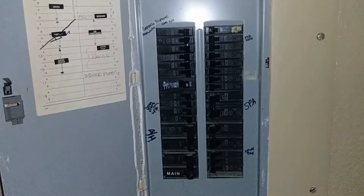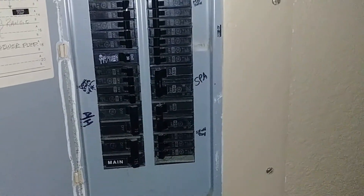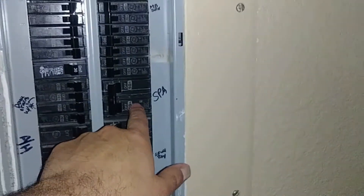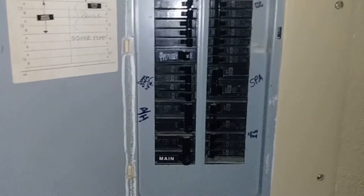So if you're about to get a hot tub, take a look at the breaker panel on the outside of your house. Make sure there's at least one big open space in your panel. If every available spot is filled with a breaker controlling something else, you'll have to swap out that breaker panel for a larger one or do some jury-rigging. This is my main breaker panel — I already have a hot tub and those breakers are right there where it says 'spa.' If I was adding one, I can see I only have one slot left, which could be a problem because the hot tub uses a double 50-amp breaker.